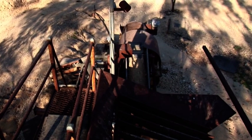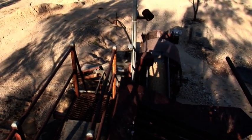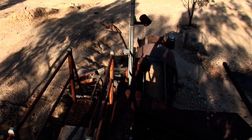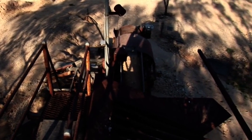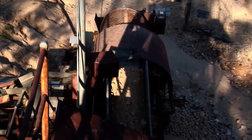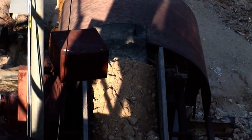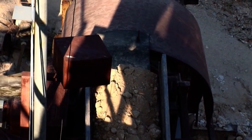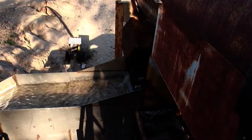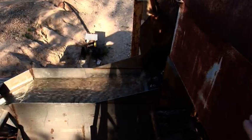That must be the best part of the day. Oh, it is, especially if you put a lot of dirt through. And I mean, a big day for me mining using that digger and bogger is sometimes up to 40 of those buckets, which is probably close to 18 to 20 cubic meters of dirt in a day. So if you've been on a good patch and put that much dirt through, you know you're going to get a nice handful of sapphires. Over that pulsator, there's ripples in there, there's bars across it, and a mesh.